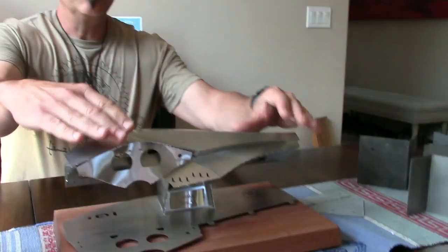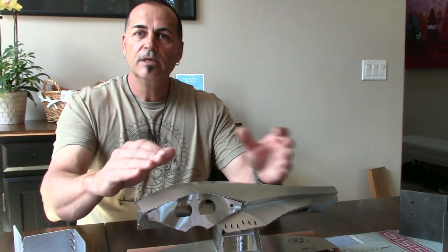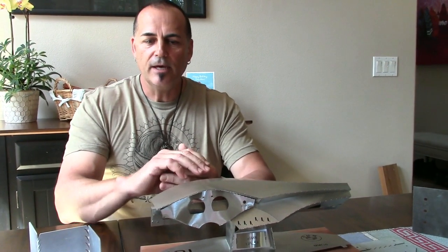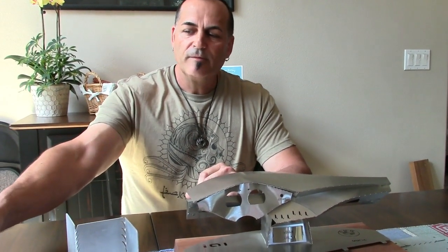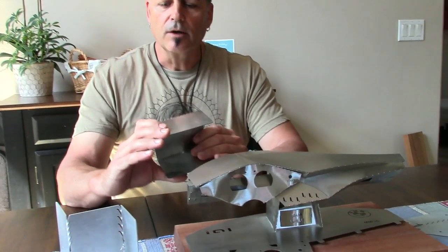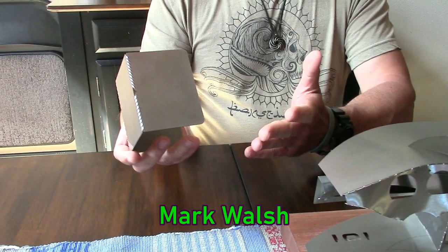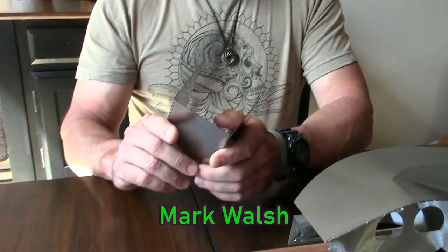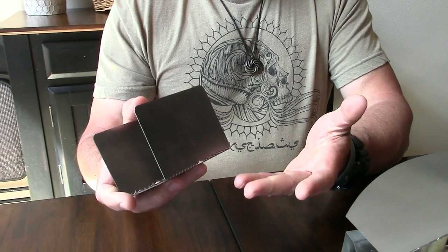Because you're creating structure, just like in this piece, right? This is a structurally sound piece. I've put curves into it. If you add folds and curves into things and put an arc into something, you've strengthened it. Some of our designs use arcs and curves to strengthen things. This is standard 304 stainless steel, which is pretty easy to bend, but not by hand — you need a press brake, you need tooling, a tool and a die, and a lot of tonnage to bend it.